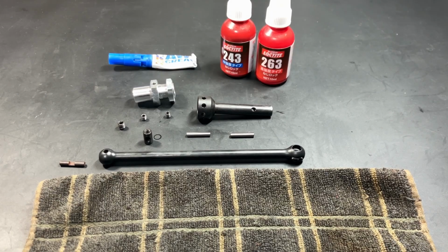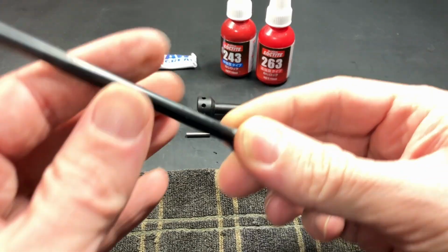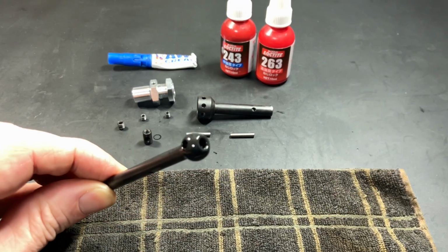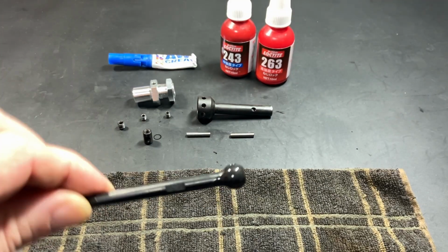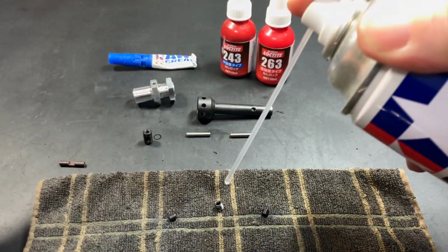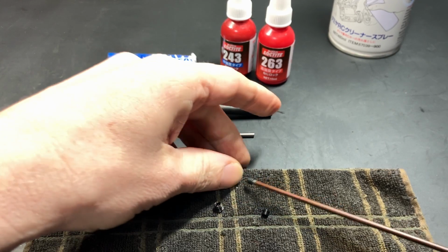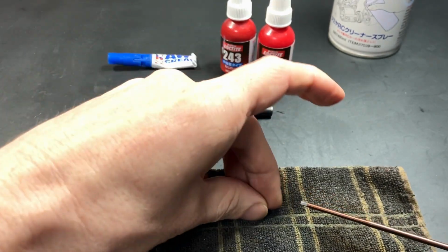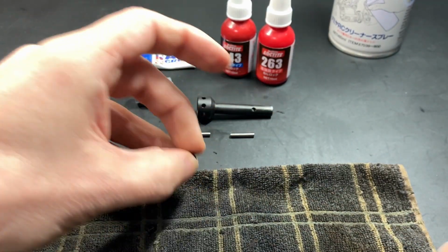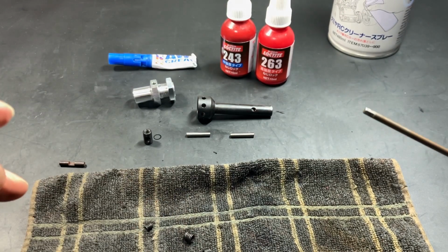During the manufacturing process, the parts have this oil on them. So the first thing you should do is make sure you clean off all this oil, off all the threads. I'm just using this Tamiya RC cleaner to degrease, and I also do the set screws. Then go a step further and give them a wipe down, just like this, and like this. And the 2.5mm wrench, clean that off, okay? Make sure they're clean.